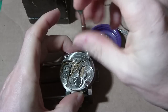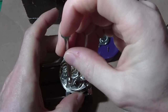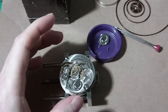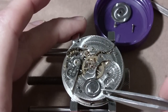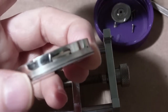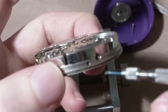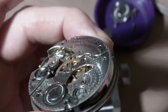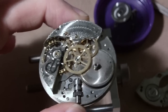I'll take out one screw, loosen the next one. They're pre-loosened because I did this earlier. Got the screws out. I'm going to remove three screws. This watch has little slots for prying off the plates — this one has two. I'm going to stick it in there and then the other one so it's loose, and I just take it with my tweezers and lift it off. There's the movement with one plate gone.